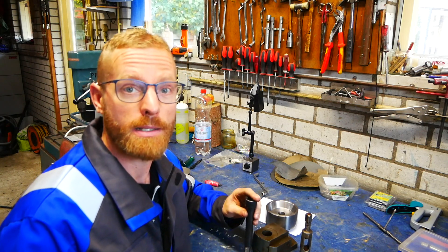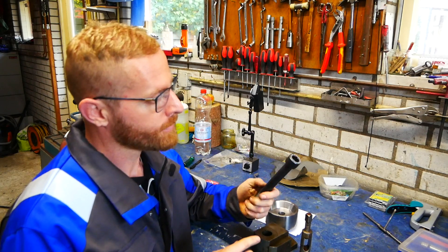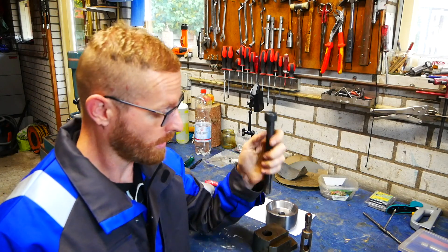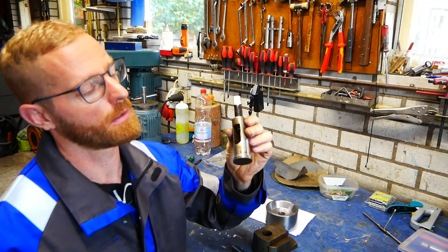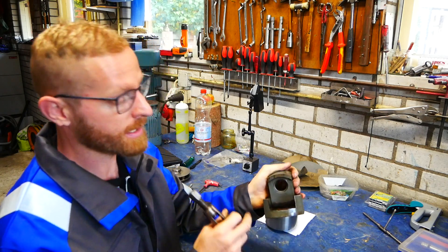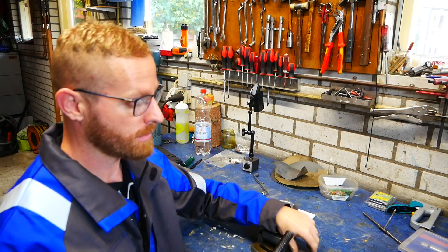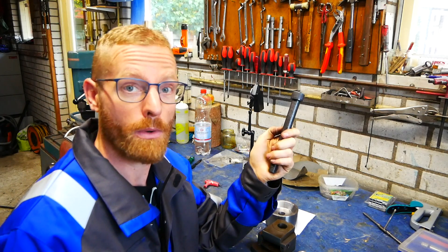I thought, what would be a good and easy design — quick and easy. I don't want to make a big two-day project out of it. And I found this nice big bolt. It's M20, 12.9 steel, so that's quite strong steel for this. The tool holder is mounted from the back and it fits inside the clapper box in here. So I'll make a bushing with the M20 thread and thread the bolt in, put a nut on the other side to mount it, cut out the head, drill and ream a hole for the cutter — quick and easy. Let's see how it works.